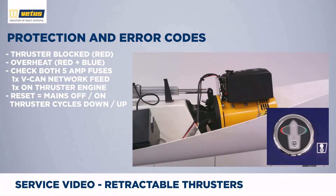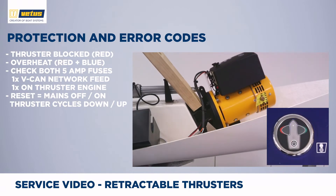Because the thruster works underneath the water level and out of sight, it needs to be very well protected against foreign objects — think of a piece of driftwood, an anchor rope, or a bit of rope caught in the thruster. In this demonstration, we are bringing the thruster to the down position, but on the inside it is blocked with a piece of wood. Usually that obstruction would be on the outside, but the principle is the same.